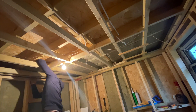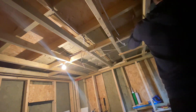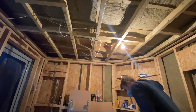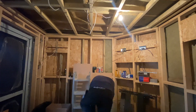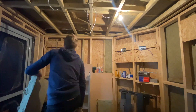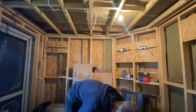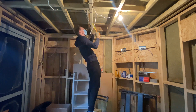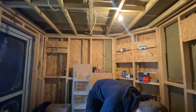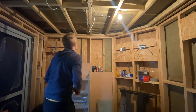As I previously mentioned in the video on wall construction, you ideally want to stick with 600 millimetre centres in your verticals so that all of your materials line up with industry standard sizing. The insulation is 600 millimetres wide so it fits nicely into the gaps in the walls with a slight bit of compression, providing a snug fit that doesn't fall out. A key thing to mention is that you don't want to over compress the insulation or really pack it into gaps, as it compromises its actual properties.